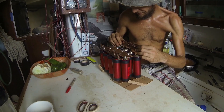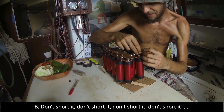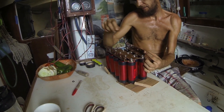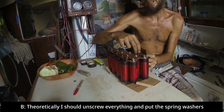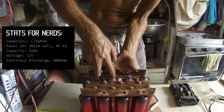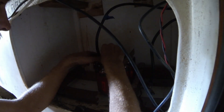Then things got even better when one day the package with our new battery cells finally arrived. Bartek put them into a pack — a modest 32 amp hour, 12 volt battery, but capable of continuous 800 amp discharge — so we could easily run our windlass off it, or weld stuff if we ever chose to. We finally had some power, as our old AGMs weren't even limping; they were convulsing at this point.